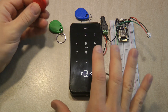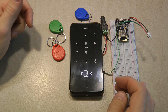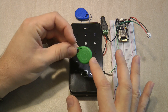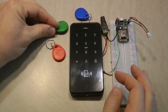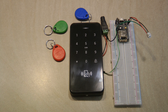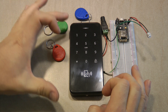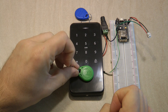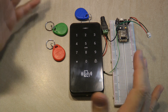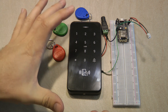The solution so far lets you read RFID tags supplied by the manufacturer and enter pin codes. In Node-RED you can assign codes and text labels to users, and Node-RED validates who scanned the RFID tag. Once a user is identified you can decide what to do — open the door, disable the alarm. There are also features to block users, restrict them to certain days of the week or hours of the day, and I also built in two-factor authentication, meaning you scan your RFID tag and then also enter a pin code.